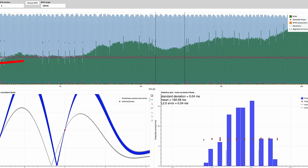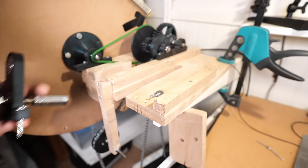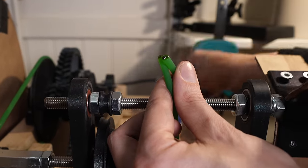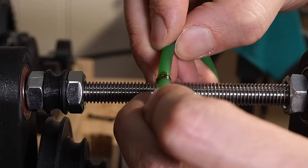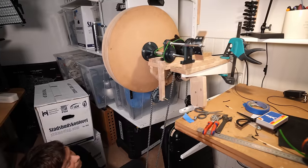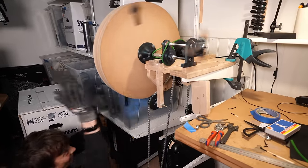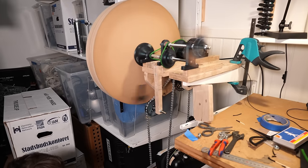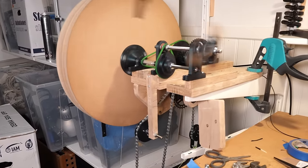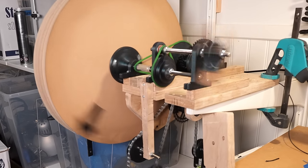But the tempo drift hasn't been solved by the new air governor. As you can see, the tempo still moves around slowly over time. A stronger flywheel will make these movements much slower and the music tighter, but I wanted to see if I can reduce the tempo drift by improving the air governor. The gear ratio I used was 1 to 2; with the pulley the gear ratio is 1 to 4, and the air governor spins 4 times when the flywheel spins once. A faster air governor will add resistance more exponentially and therefore be more precise. But the power belt I used here is less efficient compared to gears, and the high gear ratio made the whole prototype play too slow, so test 8 wasn't really great.